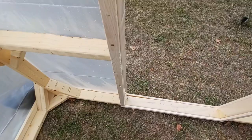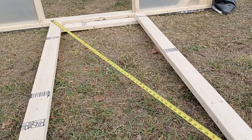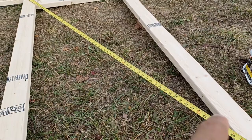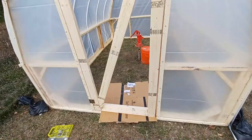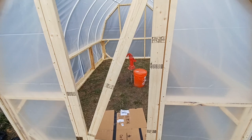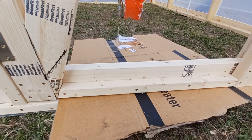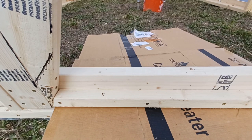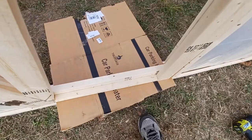I'm doing a basic simple door frame. The way I make sure it's square is to measure diagonally along both sides and make sure the number is exactly the same. I put one screw in each corner so I can adjust it until it's perfectly square, then add another screw to lock it in place. For installing the door, I like to put something underneath it — like cardboard or wooden shims — to hold it up slightly. Then I install the hinges while it's held there. Here it's just two hinges, so once I remove the shim it'll be just that perfect little distance above the door frame and can open easily.